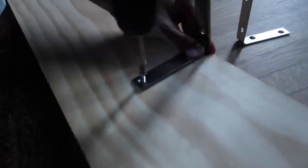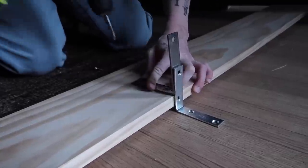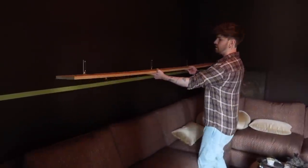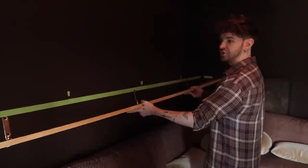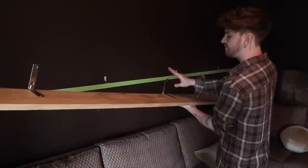Behind the longest part of the sofa, we taped off a long line with frog tape because we're going to be doing a shelf all the way across. Something needs to hold the projector, and I also want an area for decor and styling. We picked up select pine boards from Lowe's — nice and straight — and some simple L brackets to attach them to the wall, then painting it the same color as the walls so it acts as a makeshift floating shelf. We put the brackets on the top side of the shelf so the shelf weight is more supported and it doesn't have a chance to bend forward.